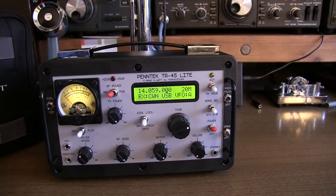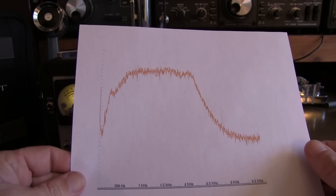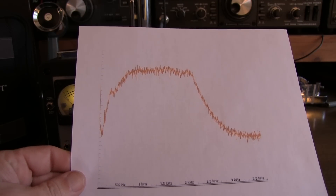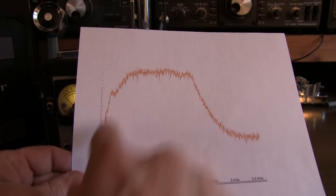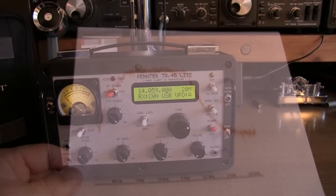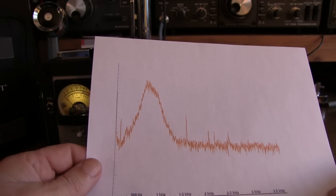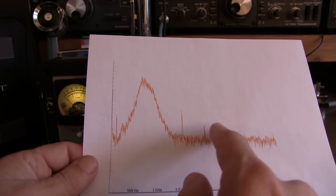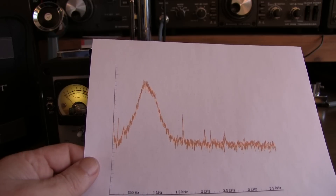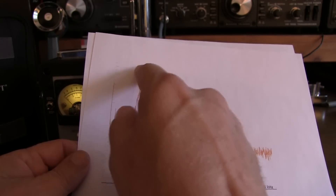I was curious about how wide those filters are, so I took the time to look at them on my scope. This is a plot of the CW wide and single sideband filter characteristic — certainly not hi-fi quality, but very good for single sideband or listening wide for CW. Probably 500 or 600 Hz to 2300 Hz of received bandwidth in the wide mode. In the CW narrow mode, we're down to about 400 Hz of bandwidth centered on about 700 Hz, where the side tone is. You can ignore the little spikes — those were noise spikes from poor grounding of the probe. In CW narrow mode you can engage the low-pass or band-pass audio filter, which sharpens that filter even further right on the side tone frequency.